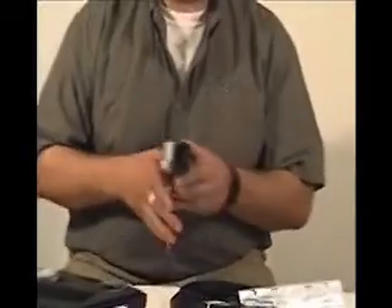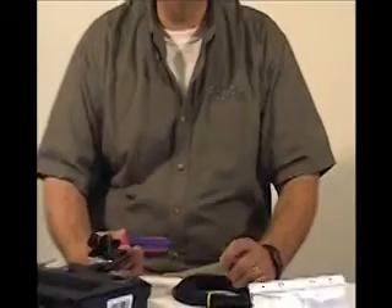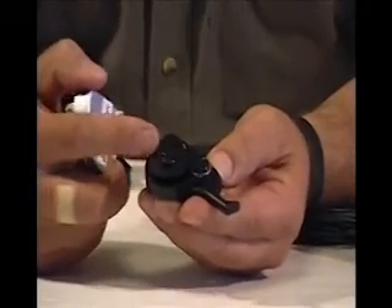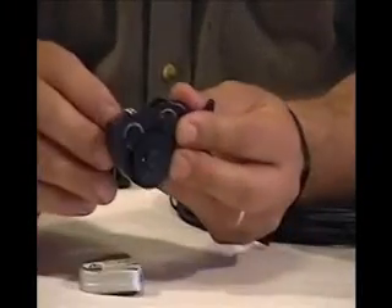This tool is so unique that it actually has a patent on it. What's unique is it does a termination on the plastic without any polishing, and it does this by crimping. As the pliers hold and crimp onto the jacket, it actually swages on and holds that jacket tight. Then the cutting blade comes in and does the termination. The cutter head has a gear on it, and this gear controls the movement of the blade.